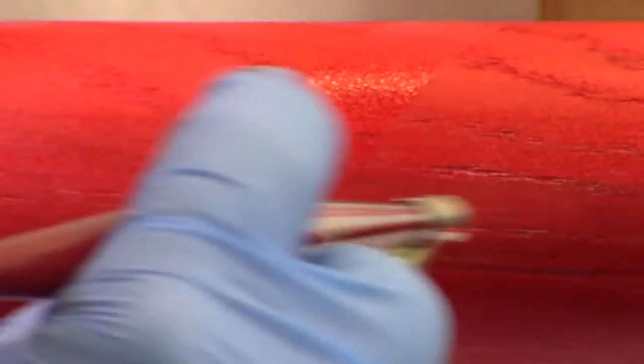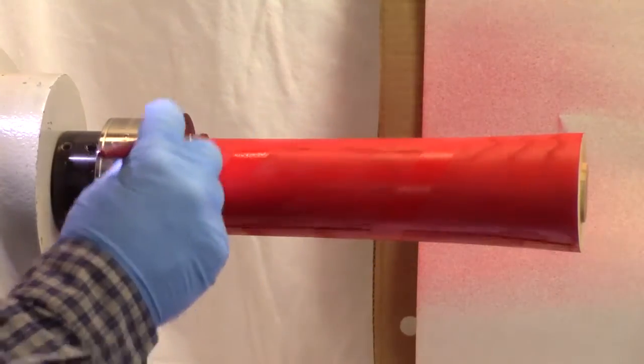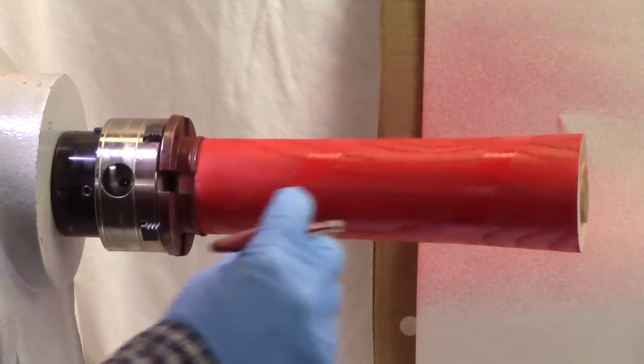The stain, or the paint that I'm putting on is such a light coat that it's providing color to the wood, but it does not have the capability of grain filling. And this is where you can get into some very, very beautiful applications. Years ago, especially in England, they used to use a product called a liming wax. And it was just basically a wax with a color in it.